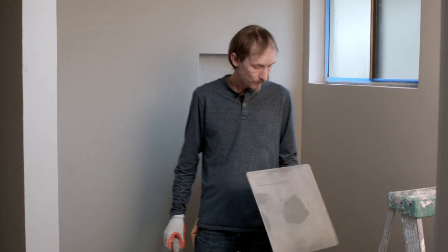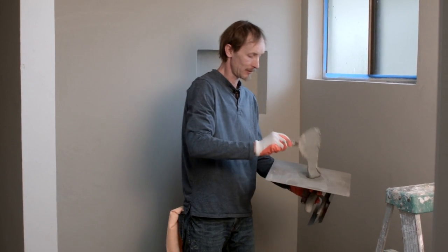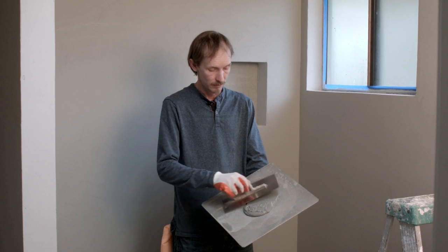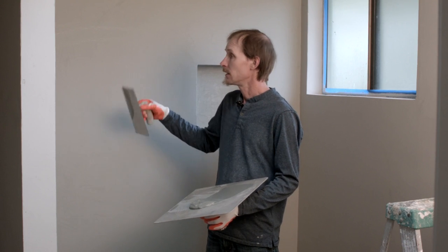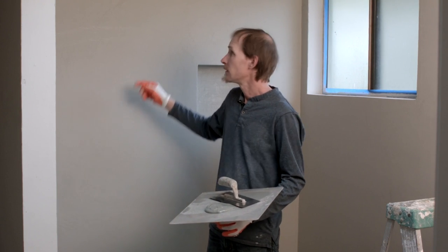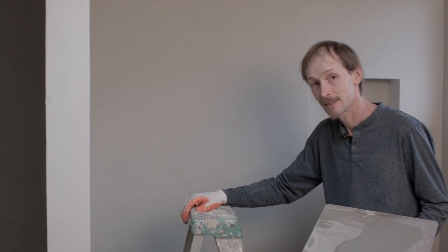The material itself kind of feels like butter or margarine. There's no aggregate to it whatsoever. So when you put it on it goes on super thin and it dries out really fast, so you just put it on the wall. Use short strokes, not long strokes, otherwise you'll get long colored lines in your wall because wherever your trowel wanders that's what's going to be your pattern in the wall. Okay, let's get started.